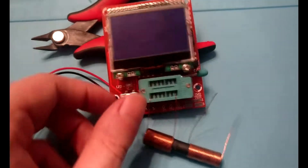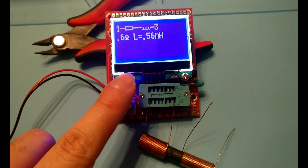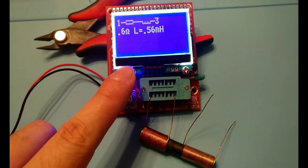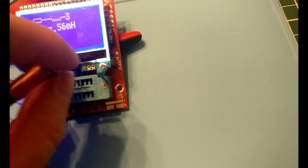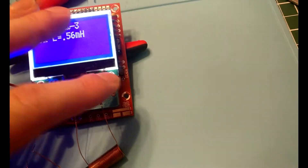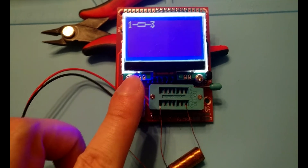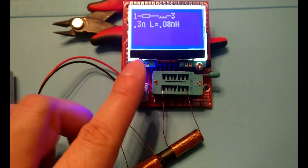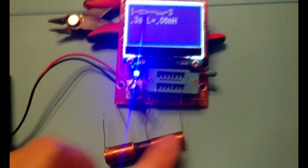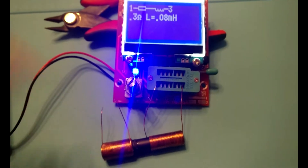If we plug this into my little inductance tester here — it says 0.56 mH, which is actually a pretty decent coil. Sorry for the lens shine on that blue light, it's really quite intense. If I quickly plug in the other coil, we do the test again and it comes across as 0.08 mH — so we definitely have working coils. When I finished winding the whole thing, I put another dab of superglue and then a light coating of superglue across the whole thing just to make sure it held together nicely.